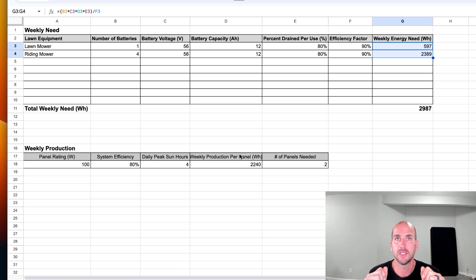One important point: make sure your battery storage — your EcoFlow or whatever batteries you're using — is sized correctly. If you expect to charge both devices on the same day, you won't get enough solar production during that single charge period, so you need to have that battery capacity already stored and ready to go. This spreadsheet — linked in the description — is how I'd size panel count, and we're also working on integrating these calculators into everydaysolar.com with additional updates.